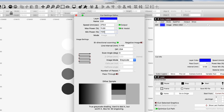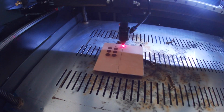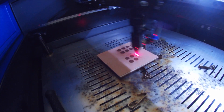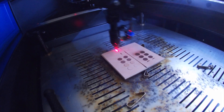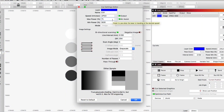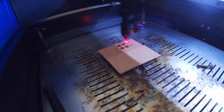You'll also see quite a bit of staining from smoke. For plywood, I had been using a max power of 20 and a minimum of 7. I actually had to lower that to 11 max and 8 minimum. That got me closer, even though I was dealing with a very small — only a 4% range in power — of this laser. I made a few more minor adjustments and I think I ended up somewhere right below 12 and right above 8. Again, a very small range of power.